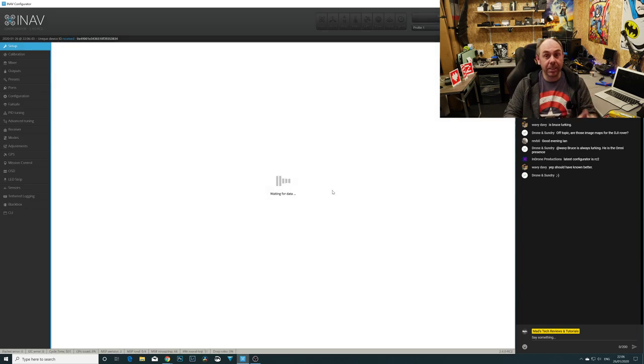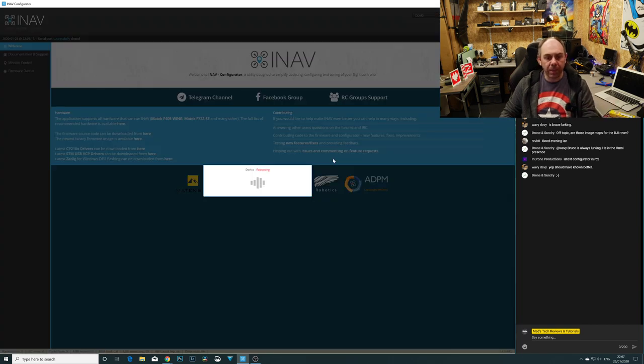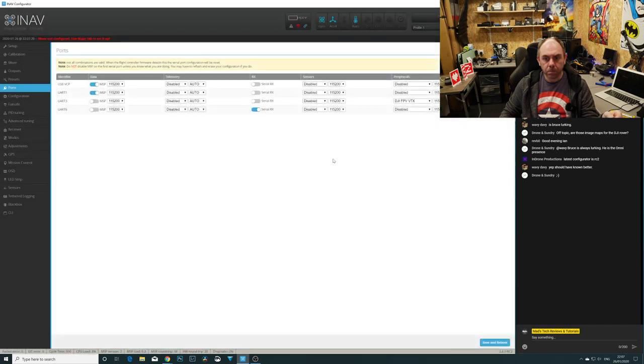And it really is as easy as that for the telemetry side. To do the RC side, if you're using the digital RC with the DJI system as well, you're going to want to make sure that you've got the SBUS Fast option turned on. This is under the configuration options. Depending on what UART port you have chosen to connect it to, you simply need to make sure that that is configured as a serial RX. For me on this one, it's serial 6. So we're going to save and reboot on that. RC2 has already landed - that tells you how quickly this is developing.